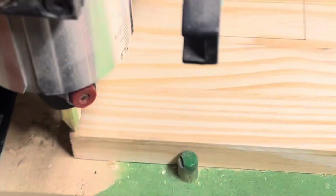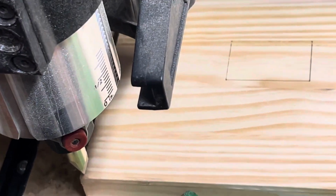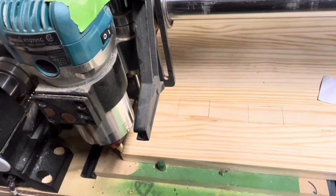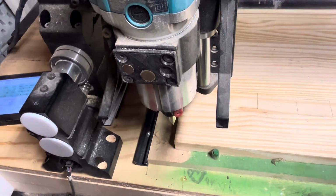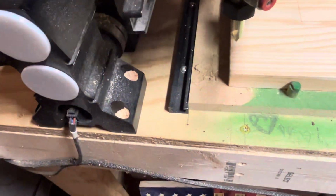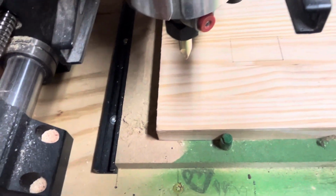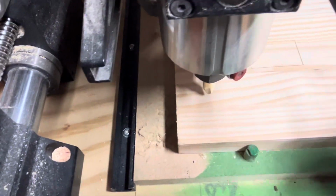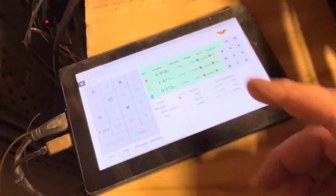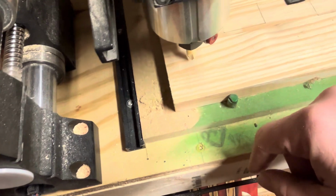Now, let's say we did that for our 1/4 inch bit for a roughing pass. You do your roughing pass, and then you change bits to, let's say, a 1/8 ball nose. You would change your bit. All your X, Y, and Z are all set to a specific spot. So then what you would do is come over to your machine. You would bring your bit over to the same area that we set the Z before, so somewhere around here. I'll sometimes do a little marker spot. And then you'll lower that down with your ball nose. You'll do the paper trick or probe, whatever you're using. And then you would hit that little toggle for the Z. And now your bit will go back to its original XY with a new Z height since you changed your bit. And then you should be good.